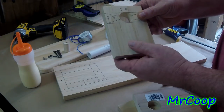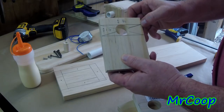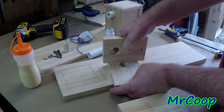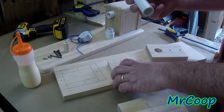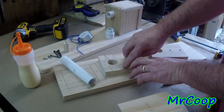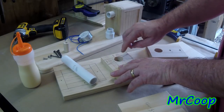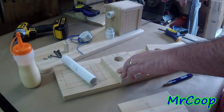Then what you'll want to do on this piece: mark down from the top three-quarters of an inch, draw a line — which is the width of one of your boards. Then you'll take your pipe, just set it right on that top line, get your mark, draw a line, and crisscross it so you can get the exact center of this board.